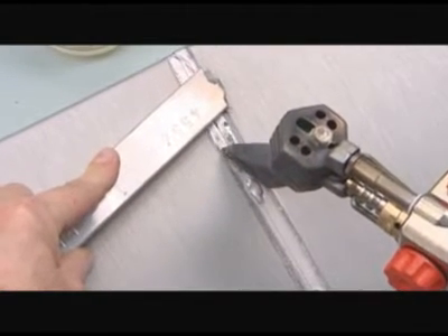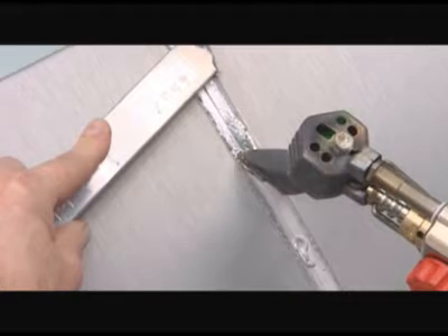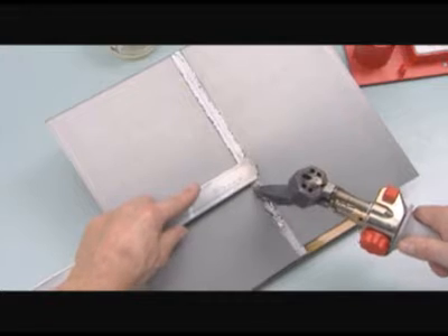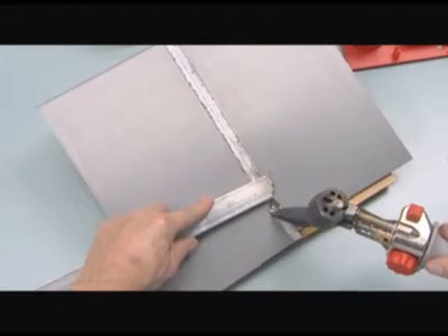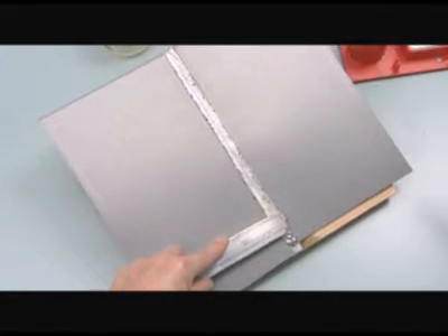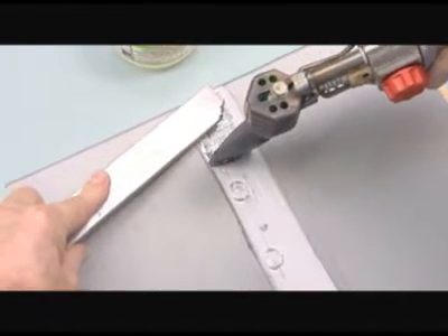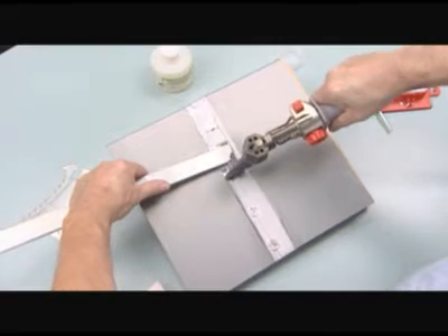After tacking, the roofer can carry out smooth soldering to join small pieces that are not subject to pressure. The quality of soldering depends on the capillary penetration and its adhesion to the parts to be joined, and not on the quantity of soldering metal. Soldering is satisfactory if penetration of the soldering metal reaches 10 mm minimum for horizontal joining, and 5 mm minimum for vertical joining.